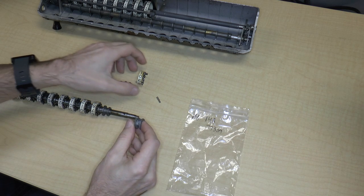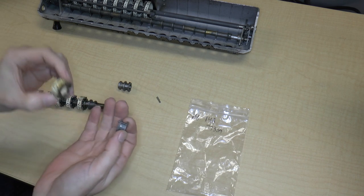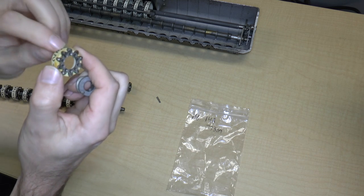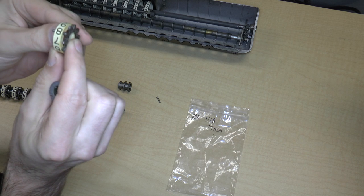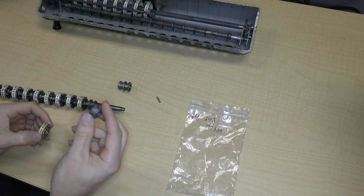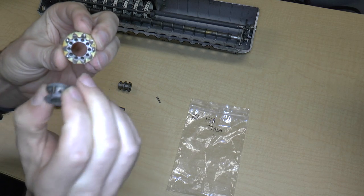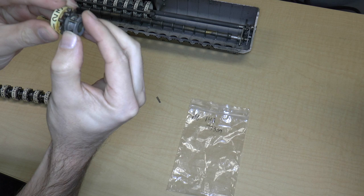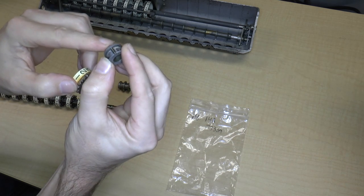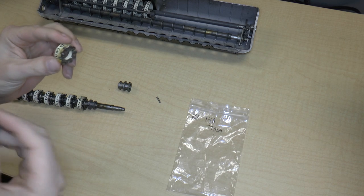These are the two parts that form the digit wheel. There is basically just a numeric wheel on a gear. There's a thing that sticks out here and a thing that sticks out here — one of them is to trigger the carry up to the next position, and one of them is for the carry mechanism to flip it by one digit. The other part here is basically just a spring-loaded detente, and you can see that there are ten little divots in here, so that when both parts fit on the shaft and the digit wheel rotates, the spring and little rod thing act as a detente, giving the wheel ten distinct positions.